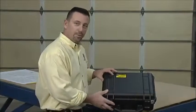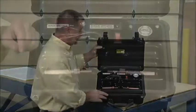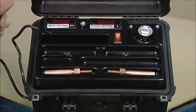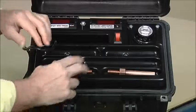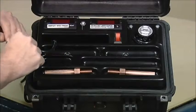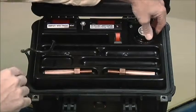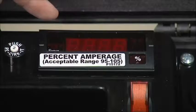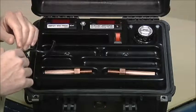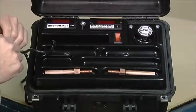This is a 7714 ground jumper tester. It's totally self-contained in a sturdy container, and inside you'll find everything you need for jumper testing — a cord for a 120-volt outlet, and you can also run it off a generator in the field. There are electrodes for standard C-clamp style jumpers, plus other accessories we'll discuss later. This is the input voltage meter, which tells you what you're putting in from the input dial. This is your percentage amperage meter, which gives you the testing result. We're looking for a range between 95 and 105. There's also an on-off switch and a circuit breaker. Everything you need is included and it's portable.